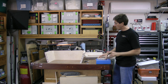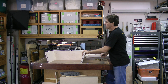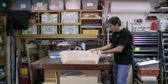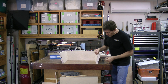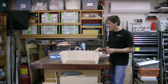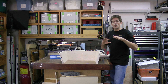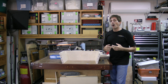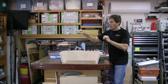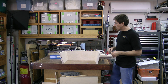Nothing can be easy, so there's something that does become difficult: how do I know where to make the cut — how high to bring the blade? The easiest solution is to simply mark on the boards where the cuts need to be — where the bottom line starts on the outside edge and on the top. Once I have those two marks for each board, I position it until the dado stack starts cutting at the right place, then adjust the height. Fortunately this board and the others across all layers will all have pretty much the same setting — only the fence position changes.